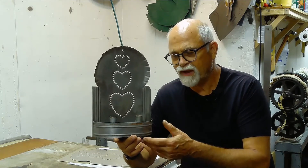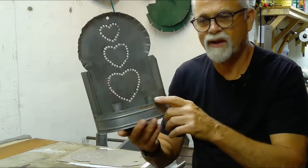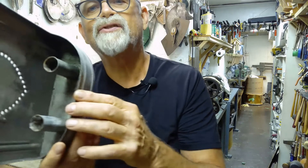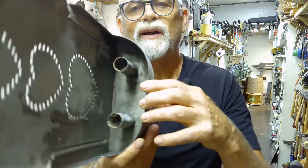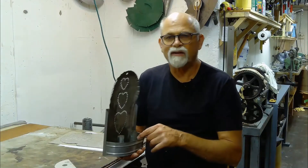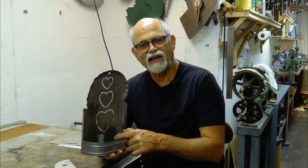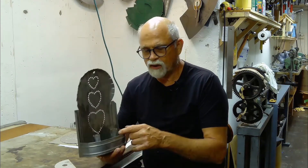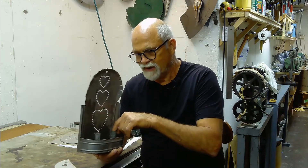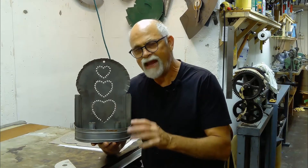This has some issues in the way it was fabricated, only because of the tools and equipment I had. On this particular sconce I didn't put the slotted candlestick holders in — if you look inside the candlesticks you can see they get plugged with wax. My new approach uses slitted openings, which are a little more difficult to make because it's hard to bend something with a tighter radius, but the slitted ones allow you to stick a knife in the slit and actually lift the candle out. Here the candle is so melted in that the only way to get it out is probably with a drill.